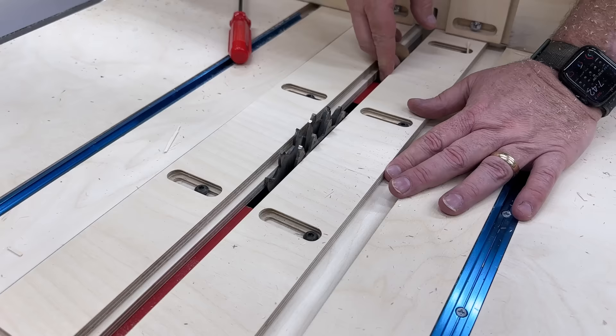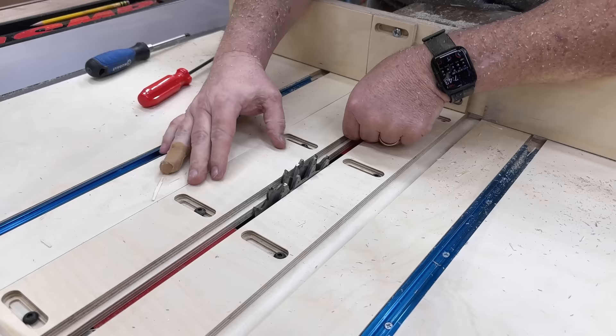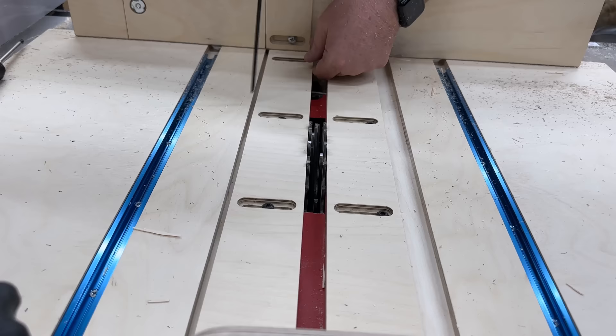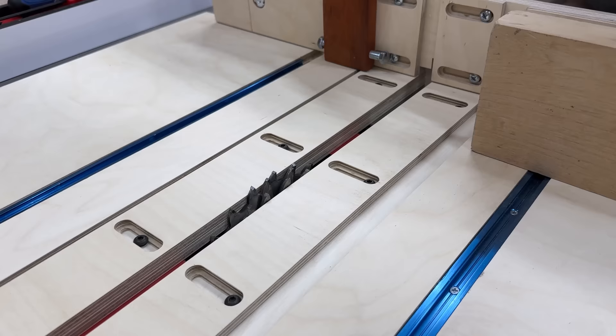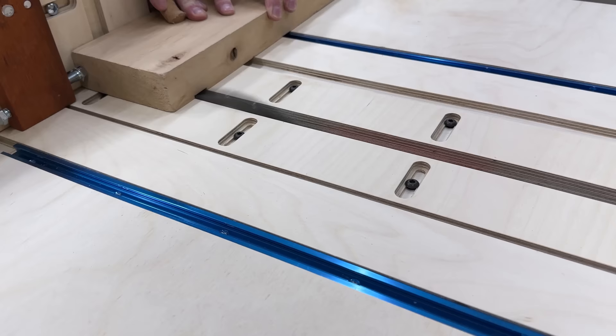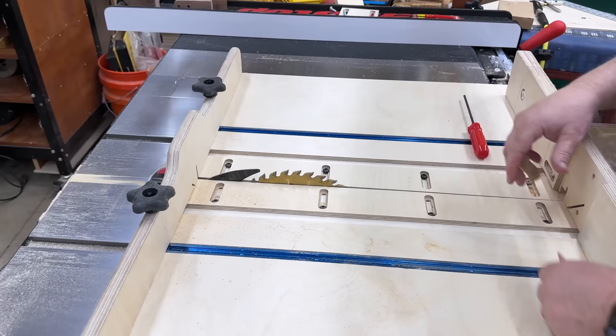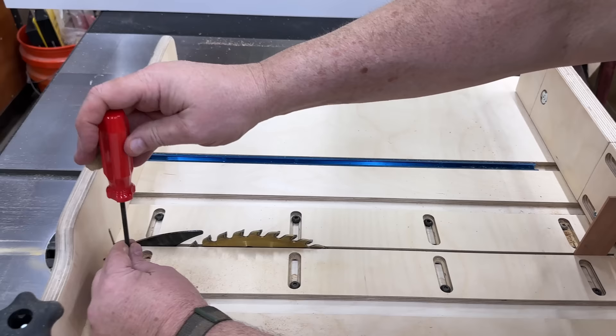Once we have the dado there, we can slide the zero clearance inserts right over to it. You want to make sure you're butting it to the carbide teeth, not to the body of the blade, otherwise you keep trimming away at your inserts until they get too small. If that does happen it's not a big deal — some people prefer to do that to make sure they absolutely have zero clearance. If you trim them away after a couple months of use, no big deal — you can make another set. Even if you buy the sled from us, I'll give you the plans with exact dimensions to make yourself another set, and we even sell the sets on our website. And that's really it — that is the dado function. Once the dado function is done it's very easy to just put the sled back together. That really concludes all of the special builds to put all of the various jigs together that the sled features. I hope you enjoyed it and thanks for watching.